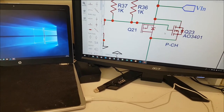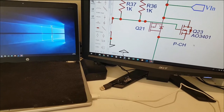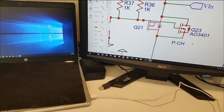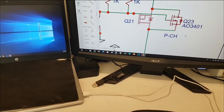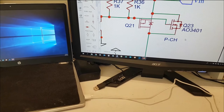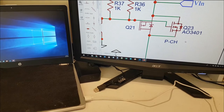Yeah, I'll probably just rushed it a bit and chucked it over here. Basically the drain and the source are back to front, so hence why when I was using the multimeter it was showing that it was turning on and off — which was good. The gate was correct but the direction of the power has gone the wrong way around.